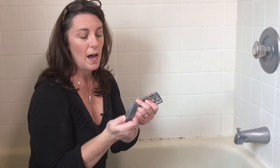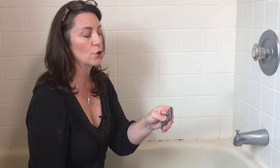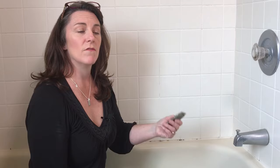It has mold, it has mildew growing on it. It just doesn't adhere well. So you're going to need a few simple tools. First being scraping tools. I like using a classic utility knife, box knife style cutter, and also a scraping razor, because that allows you to get all of this old caulk out of the way very quickly and easily.